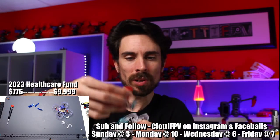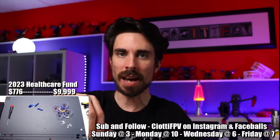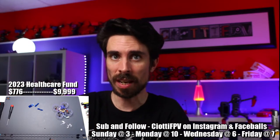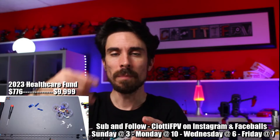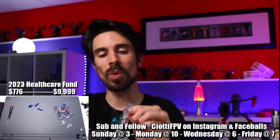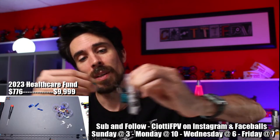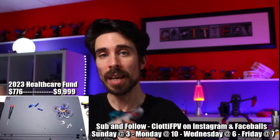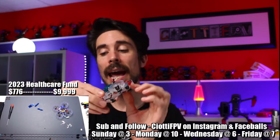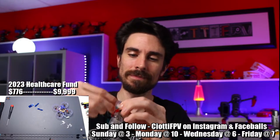The Tiny Whoop prop puller is the answer, but yesterday on the live stream, I pushed these props all the way down on the motor shaft, which helps you not bend the motor shaft, but then it makes this thing kind of hard to dig under there. So what I usually have luck doing with other props is, like I said, just taking them gently. This one came off just fine. And rotating them a little bit, and that'll get a little bit of a gap between the prop and the motor bell, and then I can get this thing in without having to really dig down in there. But yeah,